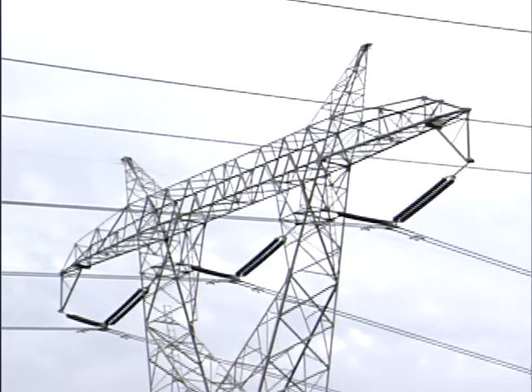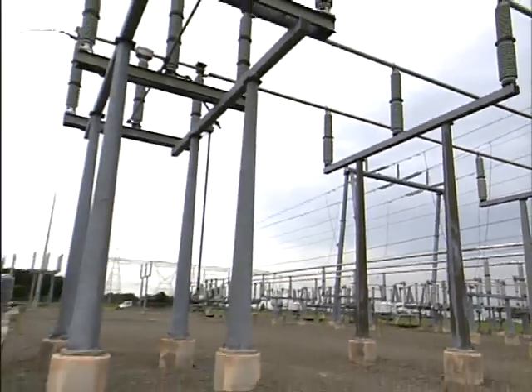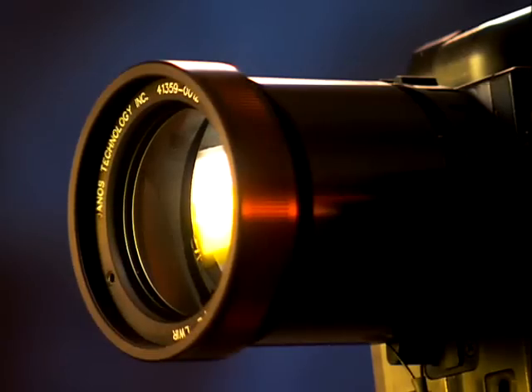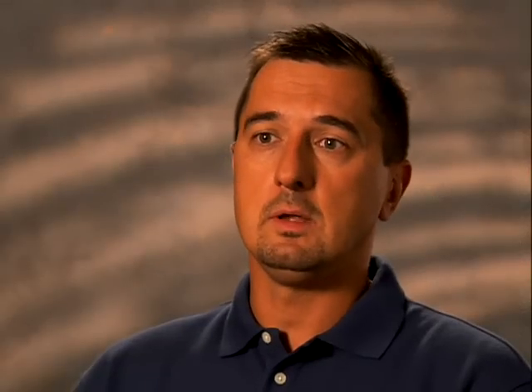The other technique utilities have used are sniffers — they're like probes. When you walk around with a sniffer, you're not going to approach a 500,000-volt ruptured disc two feet from live electricity and use one. With the Gas Finder Longwave, we can stay at a safe distance, and with interchangeable optics we can view gas leaks from an even farther distance — perhaps even outside the fence area, outside the dangerous zone.